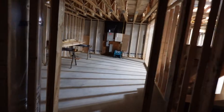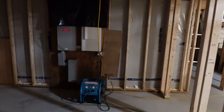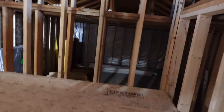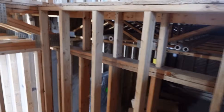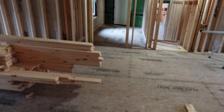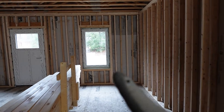That's the only penetration in the building at this point, because I don't have any of the drain waste vent, ERV vent, kitchen range hood, or dryer — none of that's poked through yet. So we have an intact air control layer. We're back up on the first floor and the double stud walls are all in.